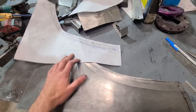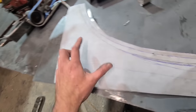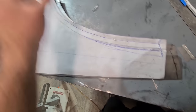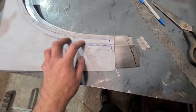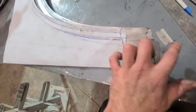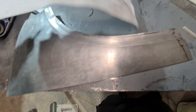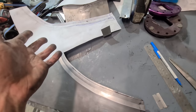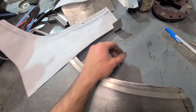Another way you can do it is have your reference mark lined up on the outside of your template and start cutting along those lines, tracing and cutting each piece as you go, then flip it over for the opposite side and opposite direction fold. You can mark it that way instead of using the razor blade, but it destroys your template at the end. So it's a choose-your-poison approach — one way is much easier to mark out but destroys your template; the other takes more finicky work but you get to keep the template.